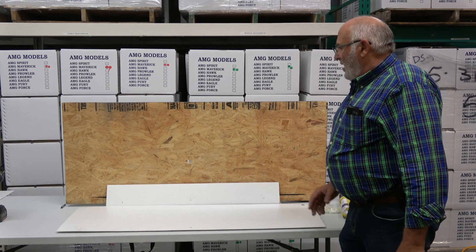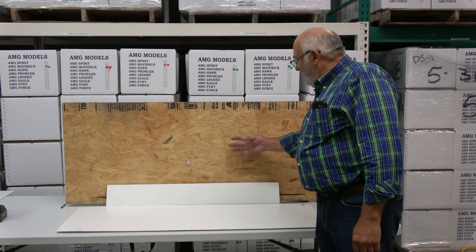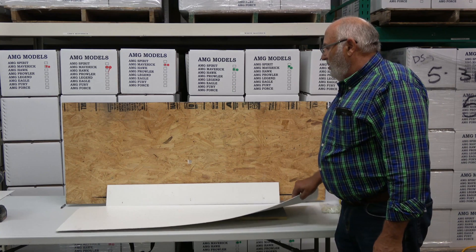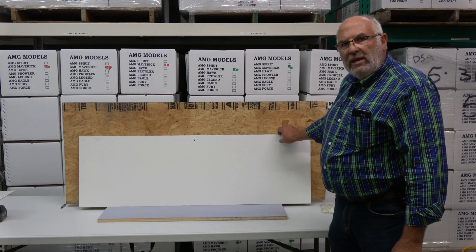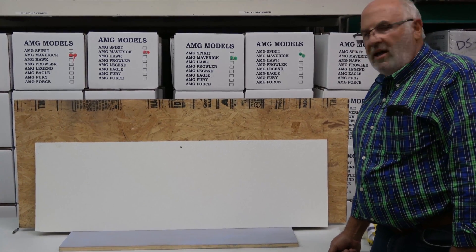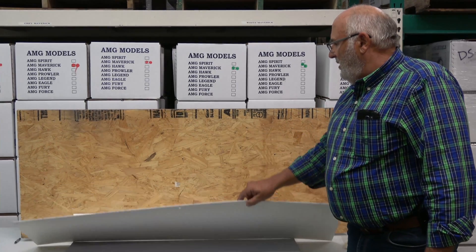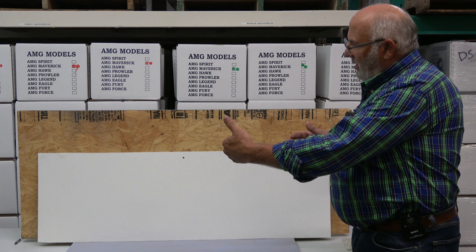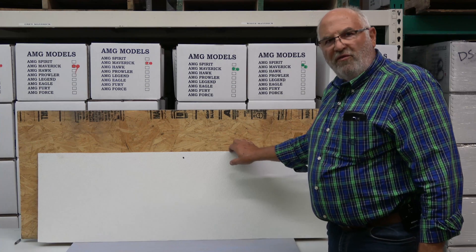Try to make friends with the dewatering company. If we're in a position where we can't, and water is coming in the walls so the lip has to do its job, then we go to your local lumber yard — Menards, Home Depot, Lowe's — and buy a product called FRP. It comes in four-by-eight sheets. FRP stands for fiberglass reinforced panels. You can rip it to any height you want. We look at the basement: if the water problem on the outer wall is only six inches high, we can rip it at ten inches. I have seen us go the full four feet before.